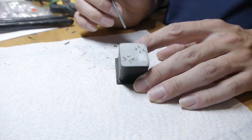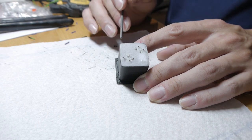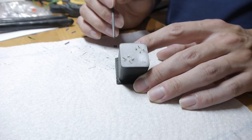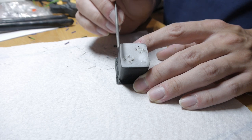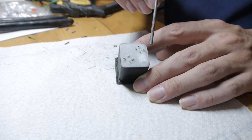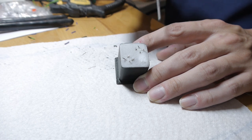So maybe you couldn't see everything I've done here because it's very difficult not to have the hand in the way. So I want to explain it again to you. I come here to the long pin of the LED, which is the anode, with a purple wire, and extend this via the short pin to the long pin of the second LED here.